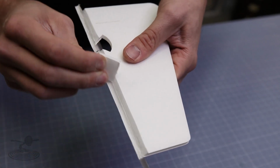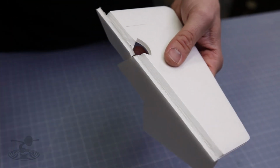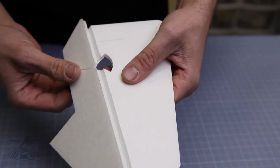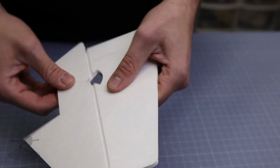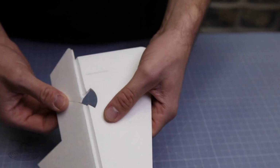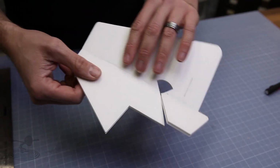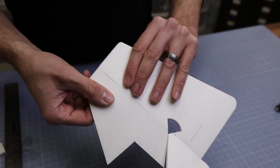What that'll do is it'll seal the paper and the foam, and also impregnate the paper and the foam and give it like an elastic rubber band feel. So just make sure before you do that that you have the throws that you want, because you can't go back in later and cut out a little bit more. But that'll keep that paper from stressing and ripping.